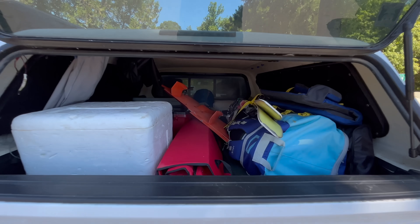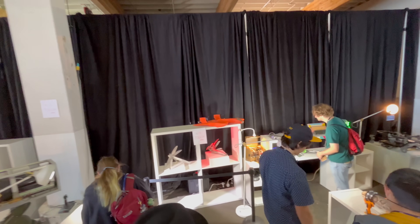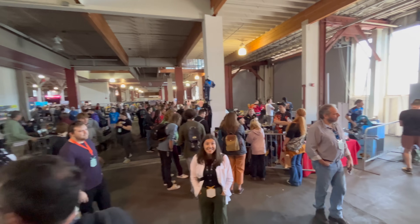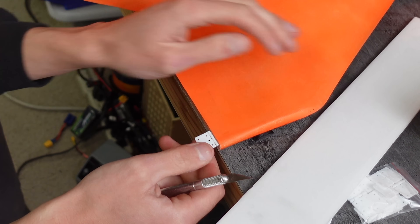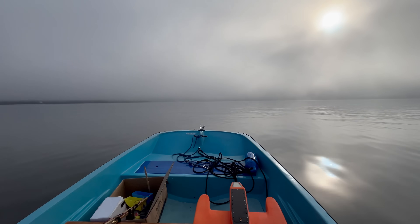Then I was back on the road, and this time the destination was San Francisco for the Open Sauce show. I was one of the featured creators and had this plane on display in the Creator Museum. After that, I took the plane home to fix it. Step one was to cut the old elevons off and then mount some plastic hinges in the foam. These got connected to new Depron elevons that I made, and then it was back out on the lake for another test.